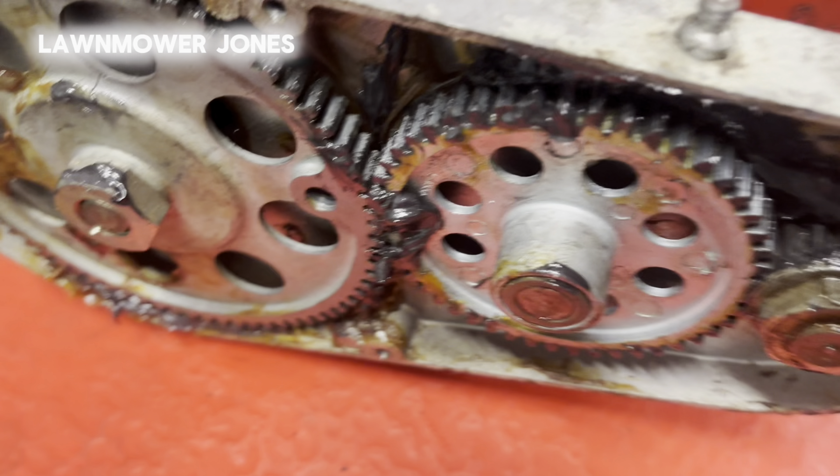These mowers will cut grass — they're that good that they don't have to be sharp to cut grass. But if you want them spot on, and the owner of this one wanted it sharpened, then if you take it to your local mower shop, most mower shops have the grinders to re-grind the cylinder and bottom blade. Once they've been done and set, you really are looking at something that should cut paper all the way along. You can just hear it — it sounds nice. This is going to be a pleasure to use. The rollers are working beautifully, dipping nicely as they should.